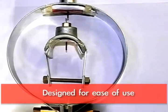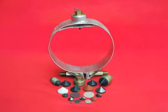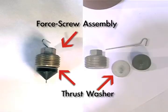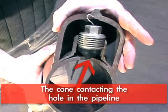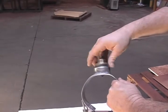The Smith Clamps are designed for ease of use. When you use the four-screw assembly, behind the seal cone there is a Teflon washer, and we call that a thrust washer. As the cone contacts the hole in the pipeline, if the hole is not perfectly round and that cone spins, it may shred.